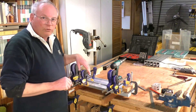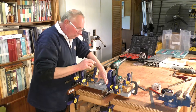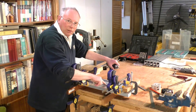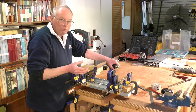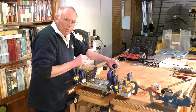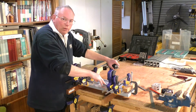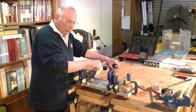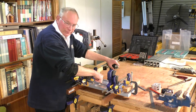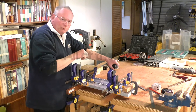What I want to do is just mark with a drill. The holes in the rail are four and a half millimeter, so I've got a four and a half millimeter drill that I'm just going to pop through the existing holes in the rail and mark the material underneath — the 160mm by 10mm plate. I want to put about four holes in, so I'm just going to mark in four places.